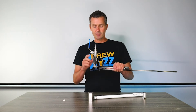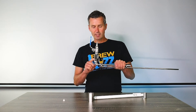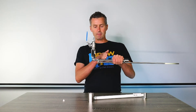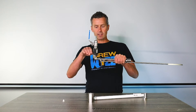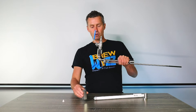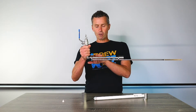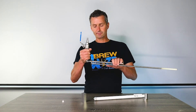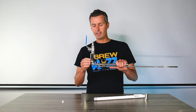More importantly is fluid-gas separation. We only want the check valve to see either fluid or gas. In the vertical position, if fluid seeps back, the check valve only sees fluid. In the horizontal direction, beer or fluid can run across the bottom of the pipe while gas runs across the top, creating fluid-gas separation — and that tends to make all check valves leak a little bit.